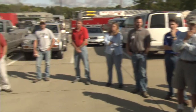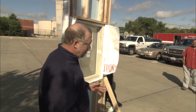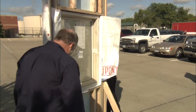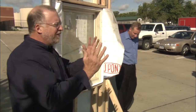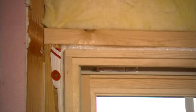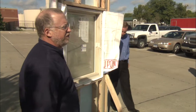Every manufacturer's different — you want to ask them, because some manufacturers say don't use any foam around here. Why? Because people go to the store and buy the maximum expanding foam. The first time I used it around a front entryway, I came back and I could not get in — that foam took that jamb and I had to cut it all out to be able to go through the door. If foam's put in correctly, it's perfect. And if your house is being sprayed with foam, those guys will do the window details for you too — that's a nice thing.